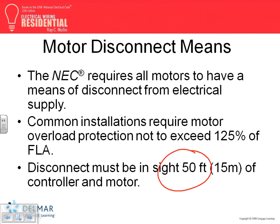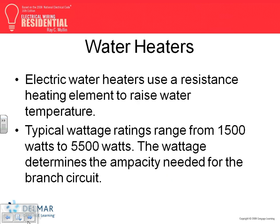Okay, any question about the pumps, guys? Really, our involvement in the pumps is sizing the conductors, disconnect, overload, controller, if any. Most of the time, we're not even involved in the controllers. When we did the city work, the city engineers have the controller. They know how the sewer system is going to flow in the city. And they decide, most of them have VFDs on them. We know how it works, but they pick the type of VFD that works in conjunction with their sump pumps, and we wire these VFDs and control them.